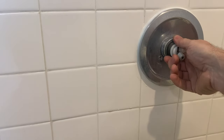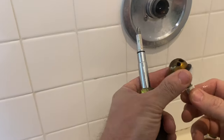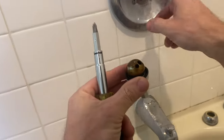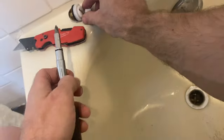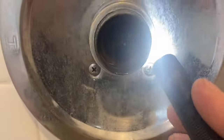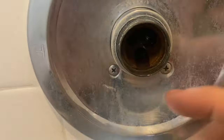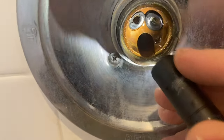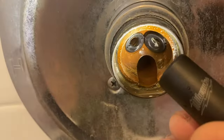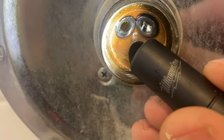I'm going to leave the outer cover on for now since they've got it sealed off and if I don't have to mess with it I won't. Inside there's basically just a ball — this isn't even a cartridge. I'm going to look in here to see if there's any debris. After you remove the ball, you can see two different valve seats with springs — those two black things in there. I can already tell by looking at the one on the left there's a split, so that's definitely damaged and that's what's letting the water come through. I'm going to pull both out and replace them.